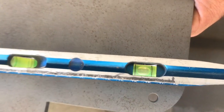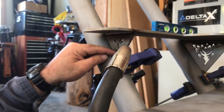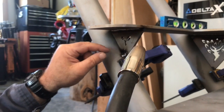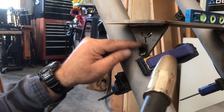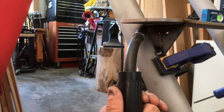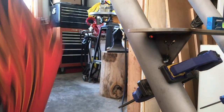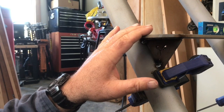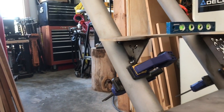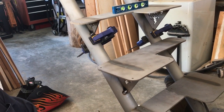All that has to happen now is to tack this tread in place. There's a little MIG wire spatter here, but that's no problem because the whole thing is going to be sandblasted before final finishing. There — that's sufficient to hold the tread; it's quite solid for fabrication purposes. We've got another half dozen more to do and then we're done.